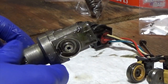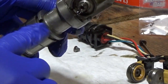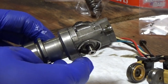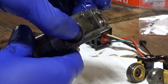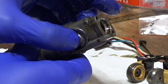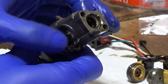When you pull your spool valve out, your spool valve has got a fatter end than the other. You always want the fatter side to be close to this when you're putting everything together. I always pay attention to how it's oriented. What I do before I pull that spool valve out is I kind of go back and forth and spin it to see if it's sticking. If it's sticking at all, that's what they call stiction — that's where it'll be rough in there. This one doesn't have any issues; it's real nice and smooth.